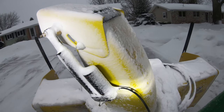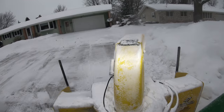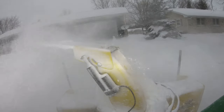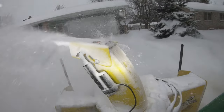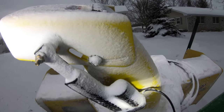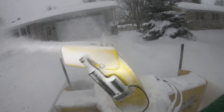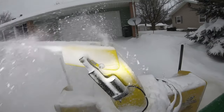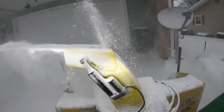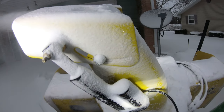When you start looking around at other snowblowers from other vendors like Kubota, the Kubota snowblower looks a lot beefier than this John Deere one. A lot of that problem has to do with the fact that they're trying to make one snowblower fit multiple pieces of equipment. With the plastic impeller too - I believe on the smaller garden tractors they don't have enough power to actually shear shear bolts, so they would damage stuff and that's why they did the plastic impeller. But that's just rumor - not confirmed.